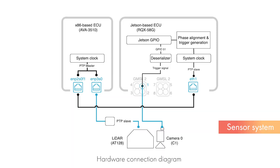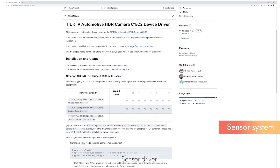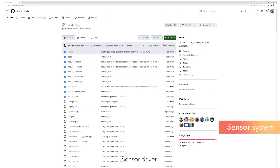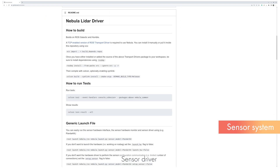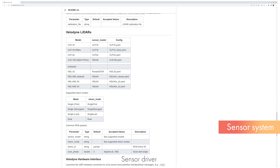Next, we will explain two points about the operation of this kit sensor system. First, let's look into the sensor drivers for the camera and LiDAR, which were installed automatically in the previous software configuration step. For the camera, images from the GMSL camera are converted to ROS topics using a ROS 2 V4L2 driver. With the LiDAR, UDP packets sent from the sensor are converted into ROS point cloud topics. These drivers have been developed by Tier 4 and are provided as open-source software.